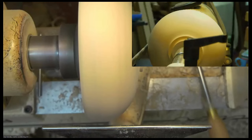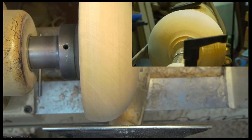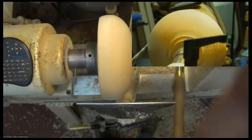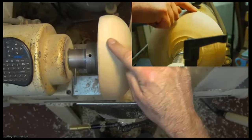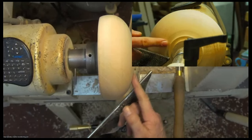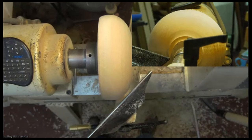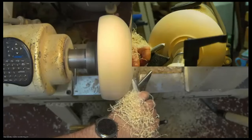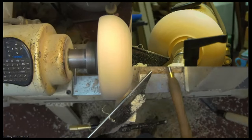That's got my overall shape now. There's a secret weapon I use at this stage for checking the shape. Visually the curve looks about right, and running my finger around it feels reasonably good — there's a little bump I can feel about three-quarters of an inch in from the foot, where I probably didn't quite blend the curve from the foot into the bottom of the bowl. I'll just adjust that and then check it again. That transition now feels better — a better curve overall.